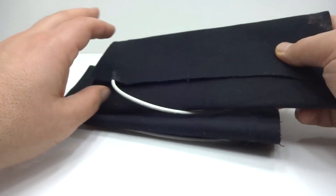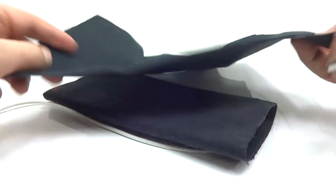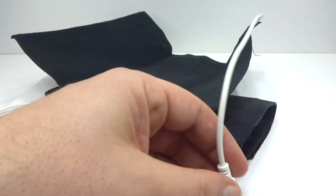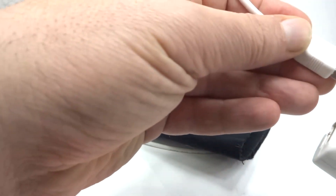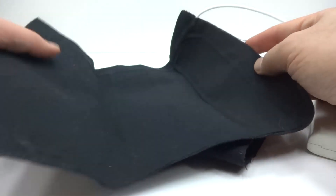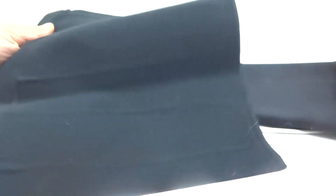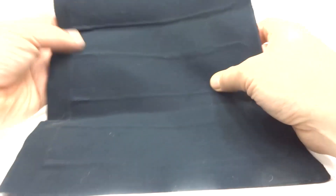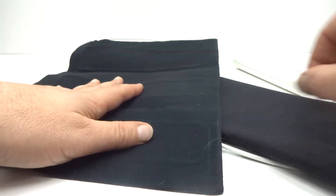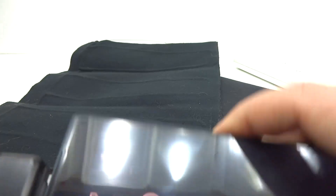I've decided to experiment with making a prototype heated jacket. I have two cloth heater elements that just plug into USB. I've tested them and they seem to draw about 1.8 amps each at 5 volts, so it's about 9 watts per cloth. With one powered up, if we get a thermal image...